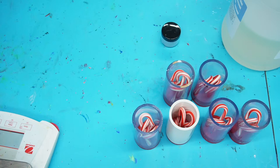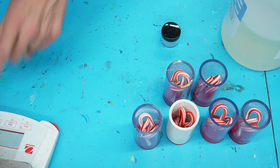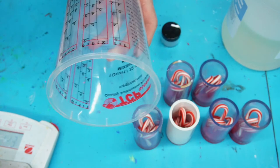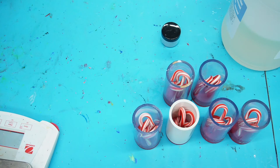I'm not a fan of volume pouring. I think it's kind of stupid. I would much rather know exactly how much is in there. I don't like these lines. And one of the other problems is you can't trust these random mixing cups. They're not necessarily accurate, in some cases. So if you've done everything and you're still having issues for some reason, the graduation lines on your cup might be screwed up or not accurate. So you've got to watch out with some of this stuff. I would much rather just grab me some resin. That's one reason why I really like Alumilite Clear Slow.